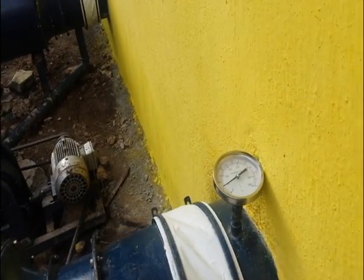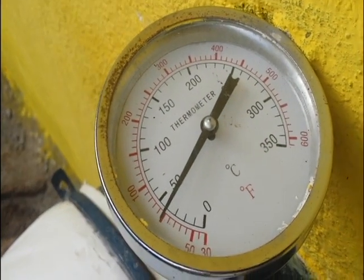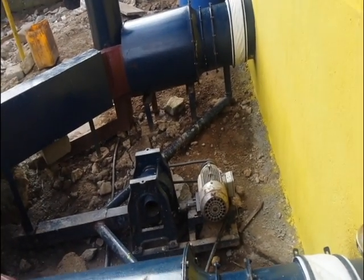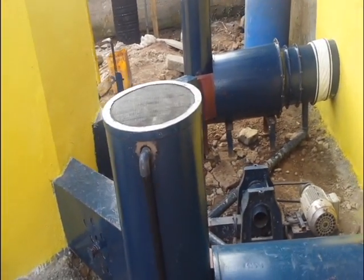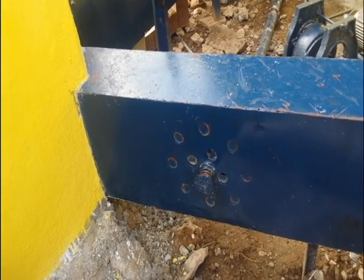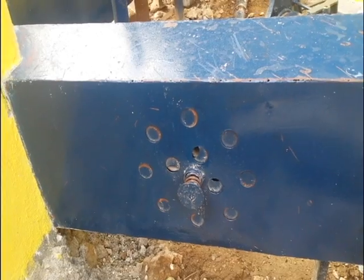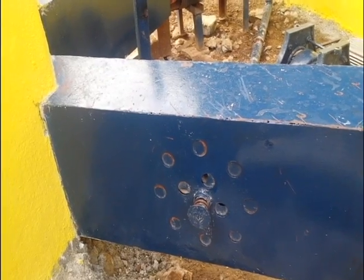The temperature you can see here is 45 degrees Celsius. Beyond that it's critical, because it's going to affect the quality of the milled rice. In the event you have high temperature, this is where you can adjust to get cold air entry into the system without going through the heater — it is just like when you are mixing hot and cold water to get the correct temperature for a bath.